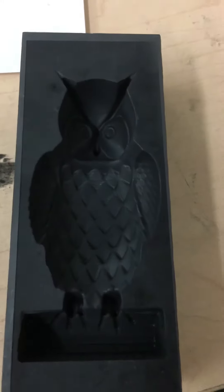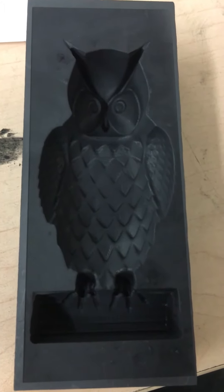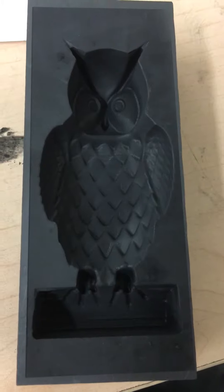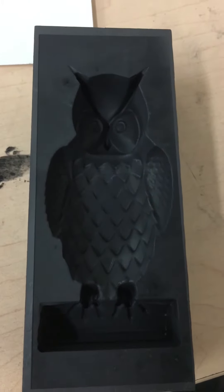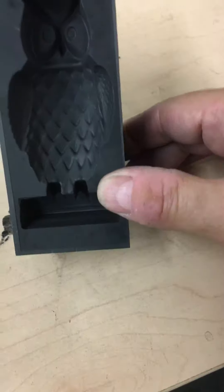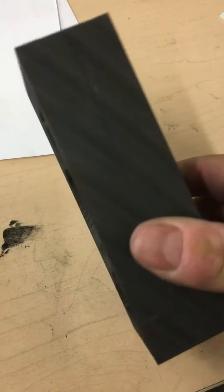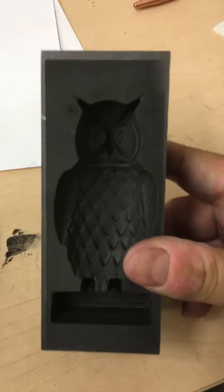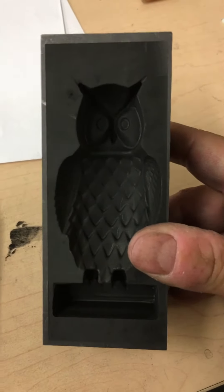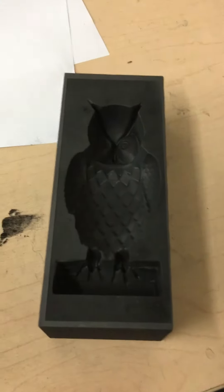I tried my hand and cut a 3D owl — this is going to be a sculpture, actually a silver sculpture. It will have a back; I'm cutting that now on the CNC machine and it will go together. I think I'll end up routing out the bottom and pouring silver in the bottom. It's the first one. We're making a two-part mold using high density graphite from a very good company.